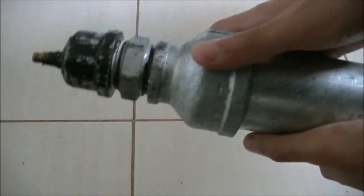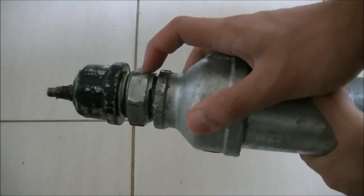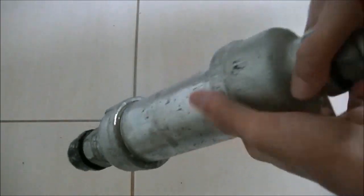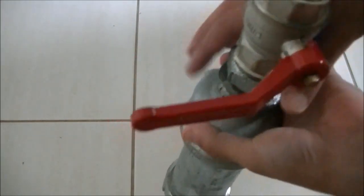It uses several fittings: here is an end cap which has a drilled hole, here is a 1-inch nipple, here is a 2-to-1-inch reducer, here is a 2-inch nipple, here is another 2-to-1-inch reducer, a 1-inch nipple, and a 1-inch ball valve.